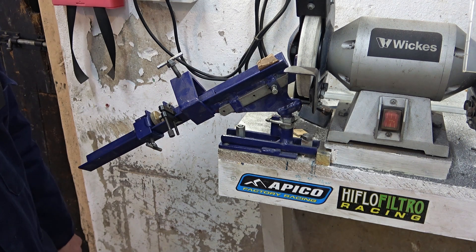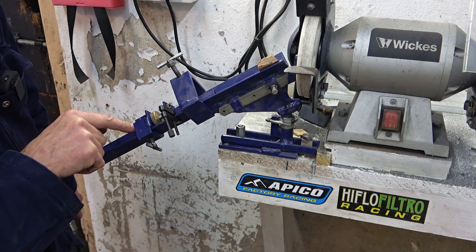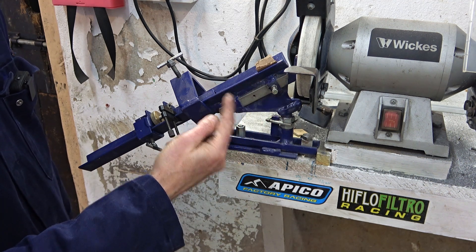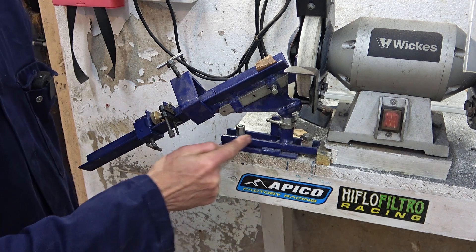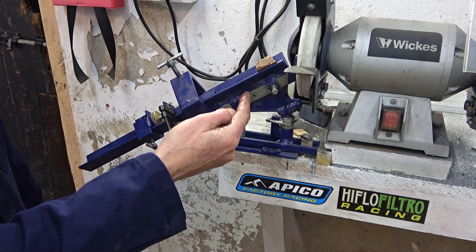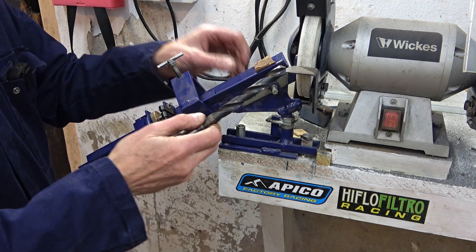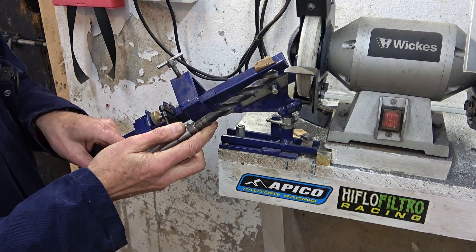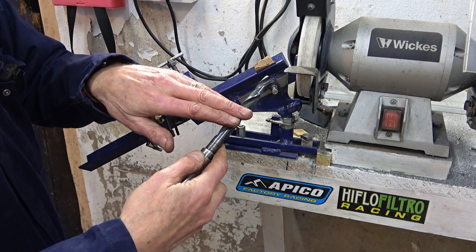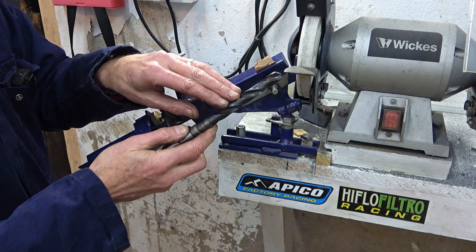The features, such as they are: angle iron, angle iron, angle iron, a screw, a piece of plate — just any old bit of plate welded onto the bottom of this piece of angle iron. This was part of a stay for a washing machine motor. To be slightly more serious: the angle of the point is set by this angle here. The drill sits at the point angle — or rather, half the point angle. And then it sweeps round to give you the relief angle, the backing-off angle — maybe 7 degrees, something like that.